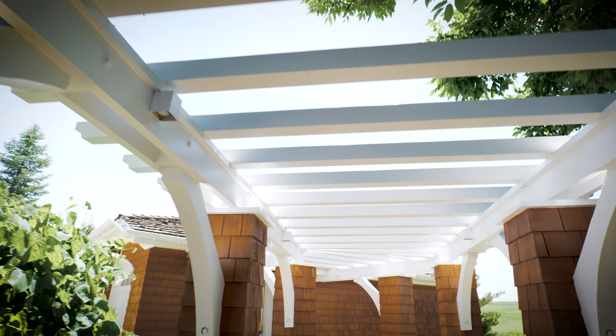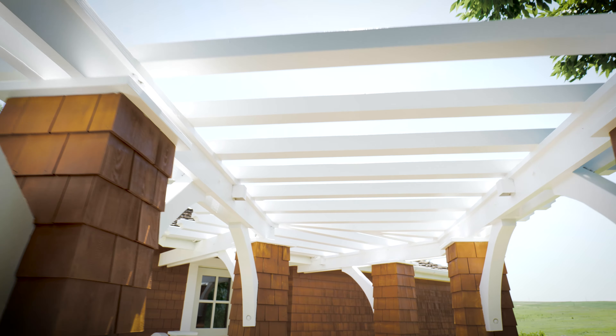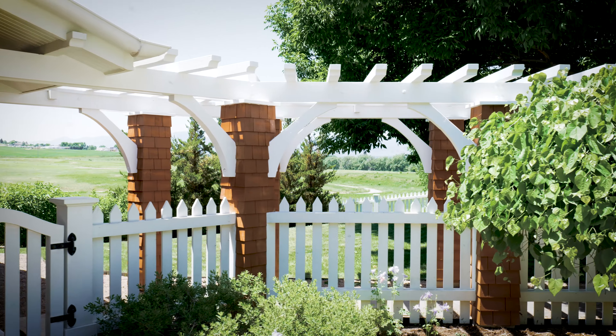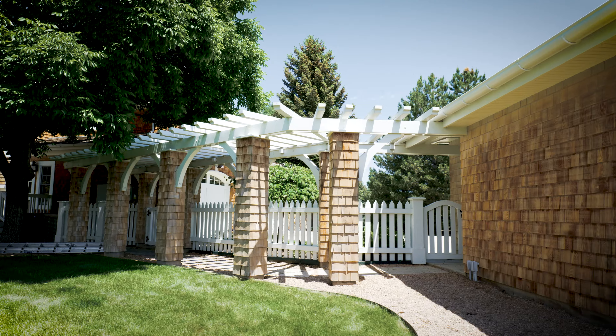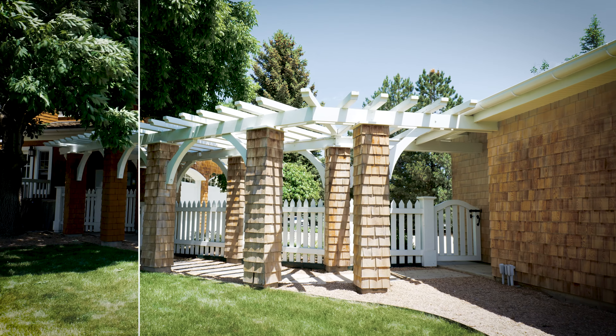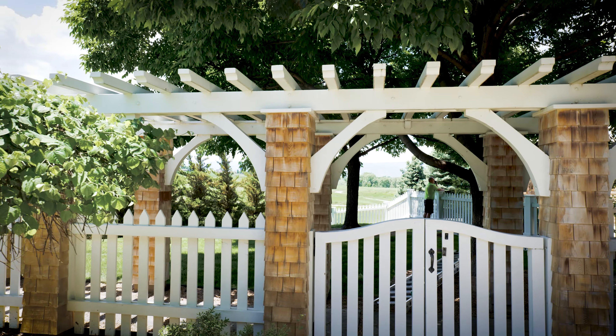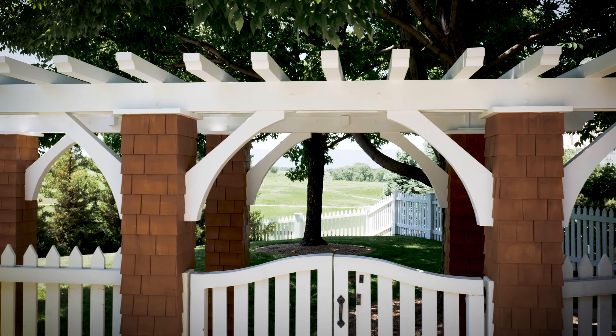The last thing we did was paint this pergola. It was very distressed, with peeling paint in several areas. We used a high-premium thick peel bonding primer called PrimeRx, which helps create a new profile for the paint. We then applied Emerald — another fantastic finish.